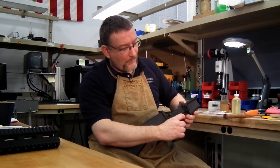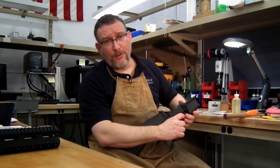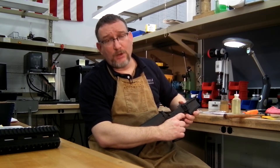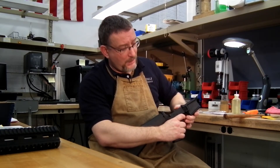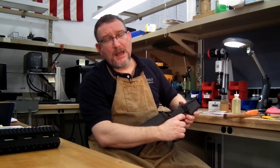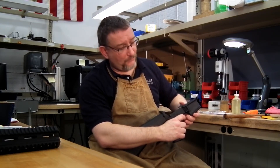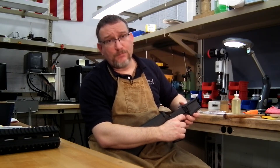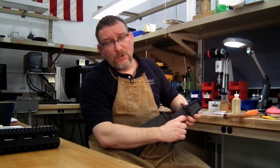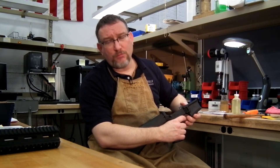This trigger without the auto sear and auto tail is also used on the Mark 11 weapon used by Crane Naval Surface Warfare Center, which has safety certified this trigger for use in Navy SOCOM. The trigger is made out of precision investment cast tool steel, double-tempered, and cryogenically treated at negative 300 degrees Fahrenheit — all the components are. All the springs are music wire, very strong, with an anti-corrosion coating.